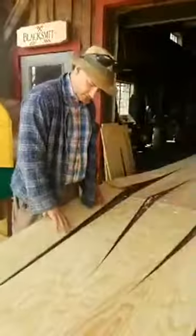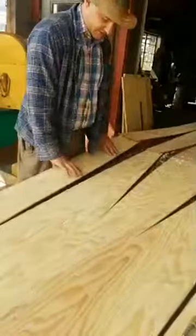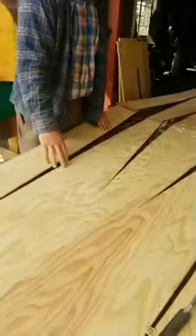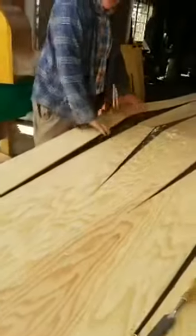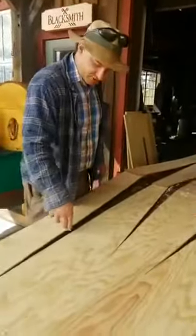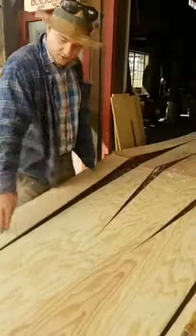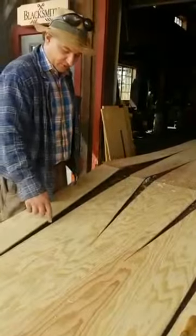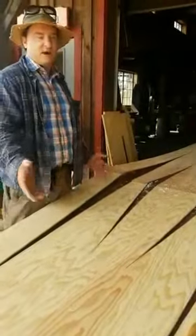On these folds that are going to fold up, once you fold up the middle of the boat, these folds change their length — the outside of the boat shifts as you fold it up. So you can't really drill pairs of holes ahead of time. I started by drilling one line of holes, and then as the boat starts to take shape, I'll come back and drill a hole across from it in the spot where it's naturally starting to fall, so I can stitch it together in the middle.